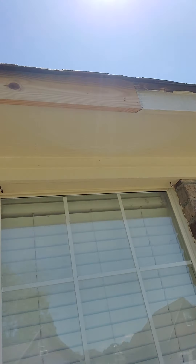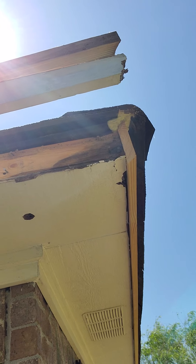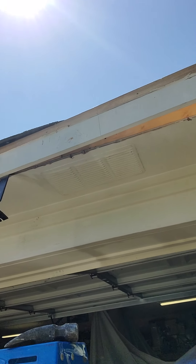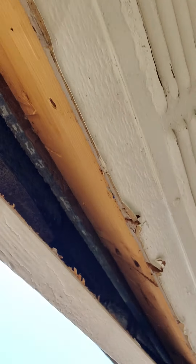The way to do it: pry it loose, cut it on a 45, tie it in. Ends up looking pretty good. Got a little bit of water damage on that 2x4, but it's not too bad — it'll be fine. What you do, you get your board, you pry it loose to where it's in some good stuff. Then you shove a pry bar or a 2x4 or something in there to space it out.